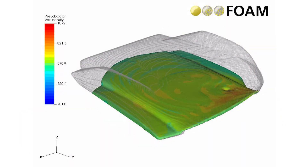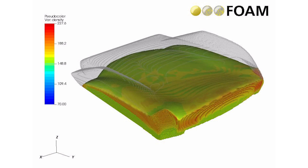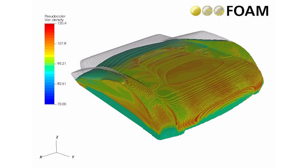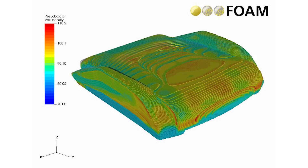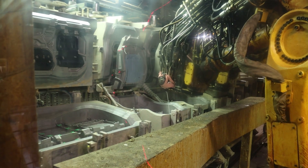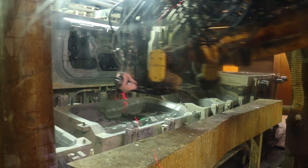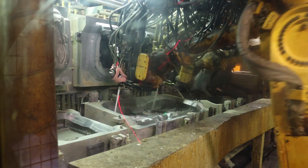The design of the seat pad is nearly limitless and completely depends on the car manufacturer's specifications. Once the liquid foam mixture is poured into the mould, a chemical reaction occurs instantly, causing the foam to rise and expand, occupying the whole shape of the mould. In the process of seat pad production, several liquid mixtures are poured, each having different properties, mainly relating to the hardness of the foam.